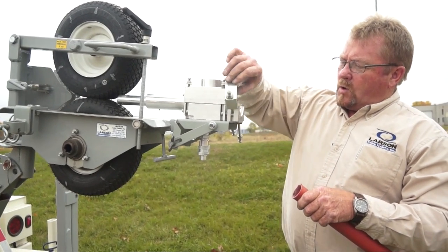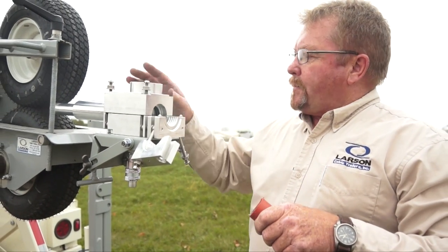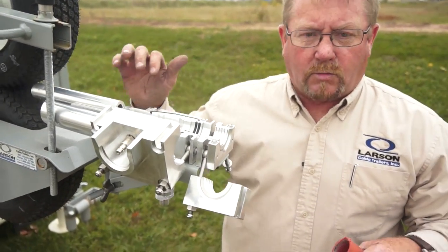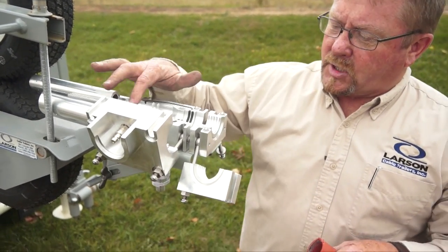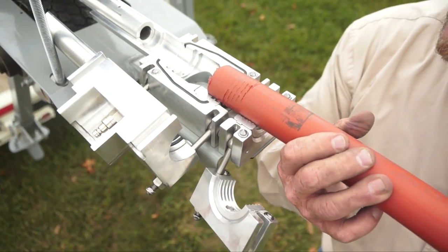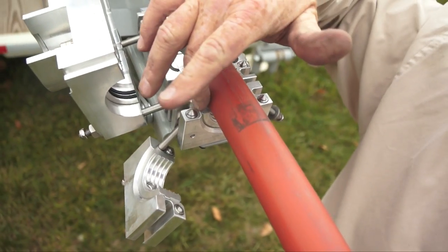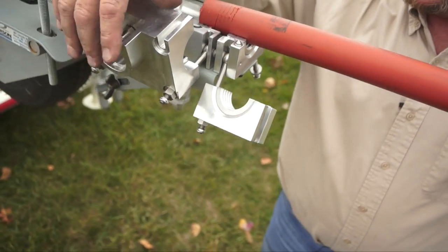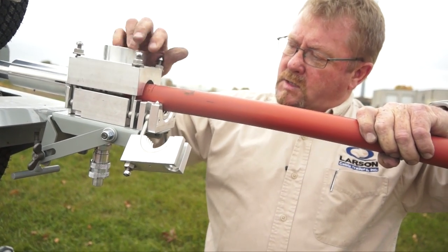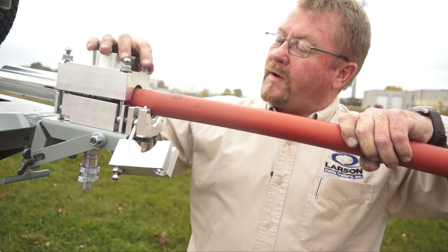With this we can actually leave the duct wide open, allowing for the larger cable to go through. Basically the same system, same venturis, same everything as the other blower, but this one seals up much better. When we place the interduct in here, we can put it right up against there — it's got rubber seals in here sealing around there, and we have this piece here with the grips on it for holding the cable into place.